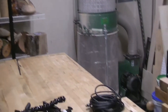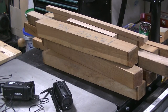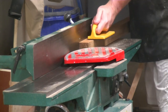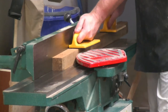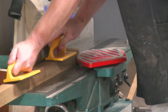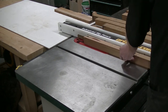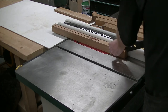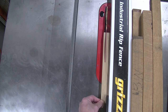What we're going to work with today is here on my table saw — quite a bit of butternut, which is donated to the club. Club members can buy these kits for $10. The first step in processing this lumber is to take it over to the jointer and put a straight and square edge on two sides. Once we've done that, I'll take it over to the table saw and rip it down to about 13 sixteenths in thickness, maybe seven eighths. You could also use a bandsaw with a rip blade if it's tuned up well, though you'd sacrifice a little less wood that way.